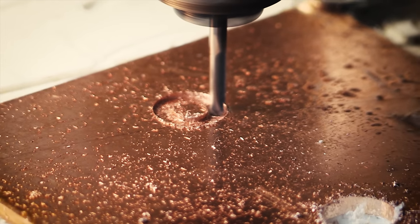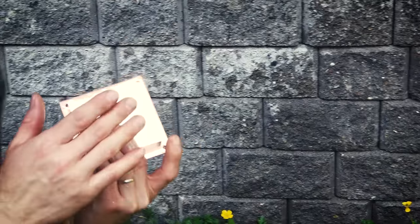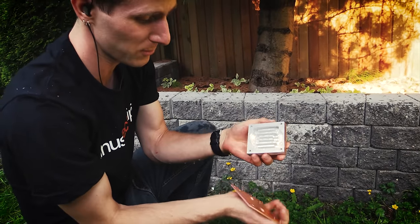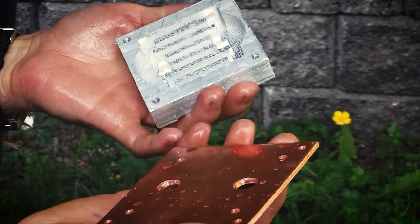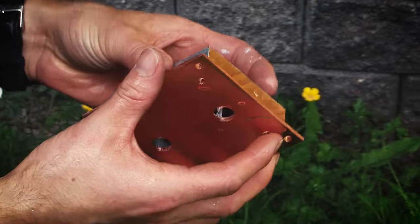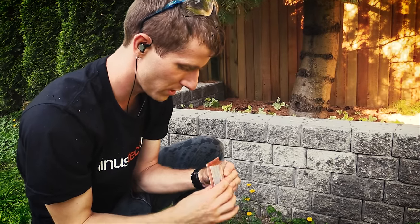The college educated among you will have noticed there are some definite marks on the bottom of the block. That's actually not as important as having a flat surface, because our thermal compound is going to fill these little micro scratches. None of the judges will ever see and appreciate the block manufacturing that went on — all they're going to see is this copper plate with a couple of nubbins sticking out. We could have done better — like having a rubber gasket sealing this or not using mixed metals — but for a homemade block, pretty darn good.